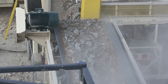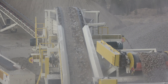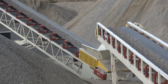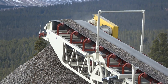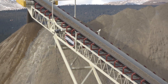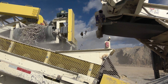One of the neat things about this plant is that most of the components for the system are actually on semi-trailers, making them easy to move from site to site. After being filtered and crushed, the system of conveyor belts hauls the material to other destinations. The right belt is coming from the jaw crusher and feeding the belt going to the cone crusher.